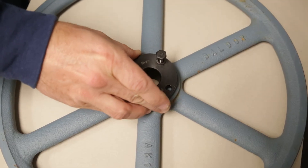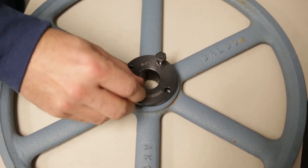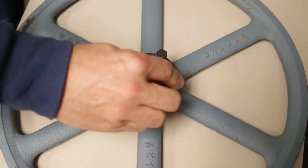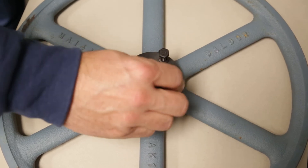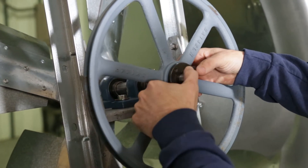The kit includes a split tapered bushing to be placed on the original pulley. Line up the open holes on the bushing with those on the pulley, then remove the screws and reinsert them into those open holes to secure it in place. Use the new keyway to align and position the pulley on the shaft.